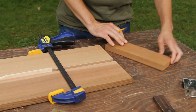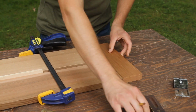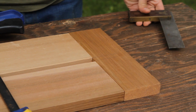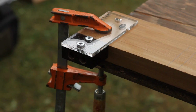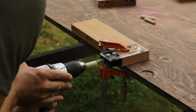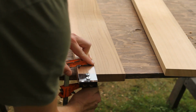To make the seat, first clamp 2 seat boards around spacers. Hold the breadboard against the ends and mark where they butt into it. These are guidelines for the doweling jig. Clamp your jig over a breadboard lined up with the outside edge. Drill 1 pair of holes, reposition the jig and drill 2 more, and then keep going until you have 4 pairs of holes altogether.